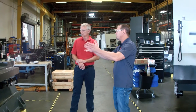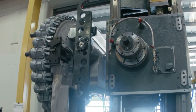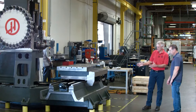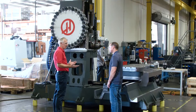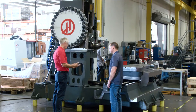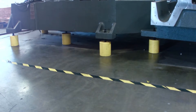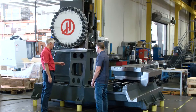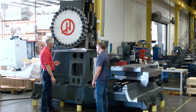The real obvious one is looking at this machine with no sheet metal. Without the sheet metal, you can see everything we did. We started right at the base — used to be two pieces. By making it one piece, it's a little harder to make. We got rid of all this unnecessary cast iron for the connection and the pads. The ribbing underneath, we moved all the feet, we gave it a much wider stance. We especially changed it under the tool changer mount and shaped it so the tool changer actually acts as a dampener.